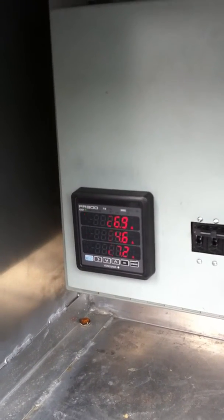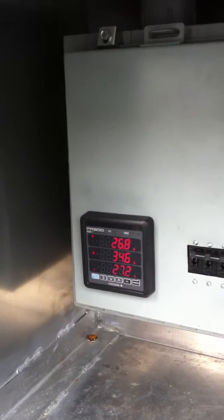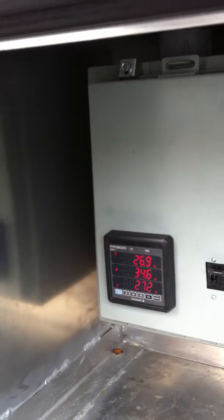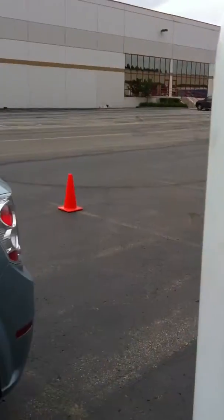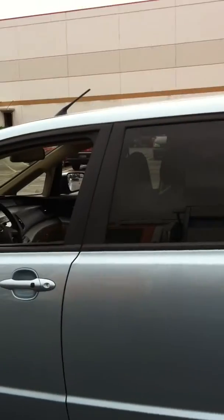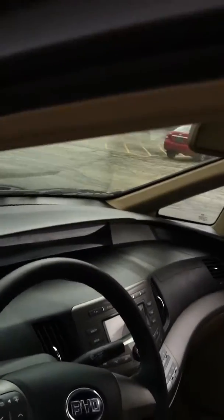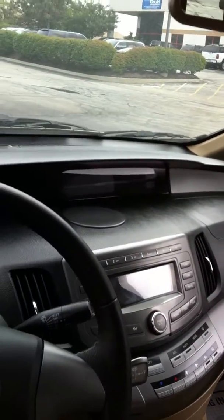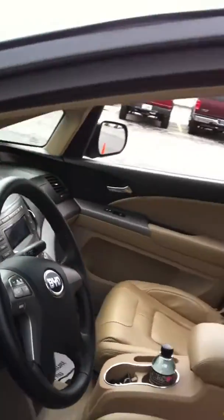On the other two legs, around 27 amps. So this three-phase system is drawing between 27 and 35 amps to support the charger. This has been running now just for a few minutes and everything is moving ahead. The charge going into the car is being registered on the car's instrumentation as well — pretty soon we'd expect a full charge on the car and ready to bring back in.